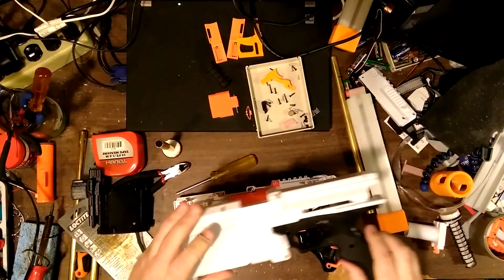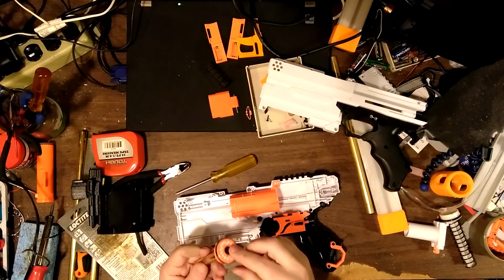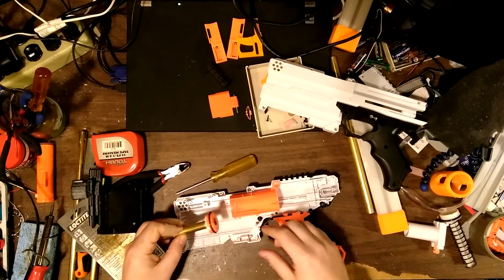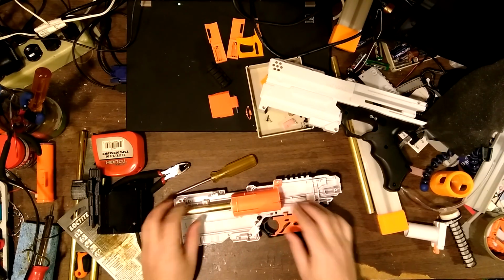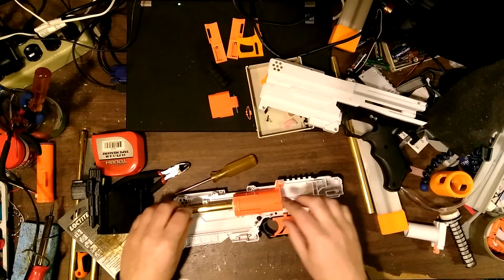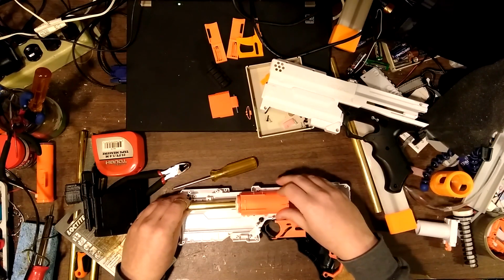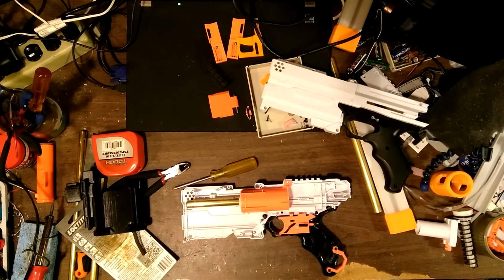So, next steps include the following. I'm going to use some plastic bonder to adhere this piece into here. That might not be necessary, but I have noticed in my testing that sometimes when I prime it back, this piece would remain here like that, simply because of the friction between the two gauges of brass.